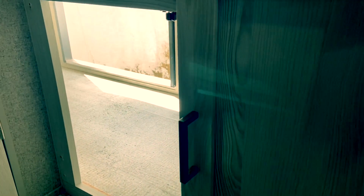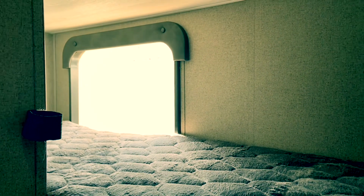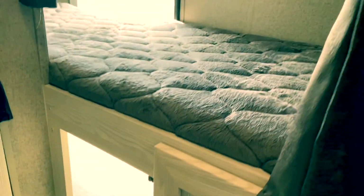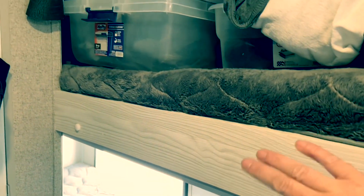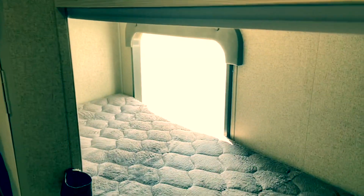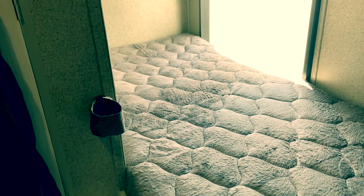So it does have a tiny door that goes outside. It's like a half-size door, I guess, maybe 2/3. So we're going to gut this and take out the rest of this cabinetry, this middle board, because it's not structural, and then this board. We'll actually take this and put it at the top like a header, but this won't have a door on it. It'll just be open.